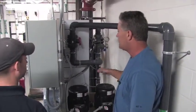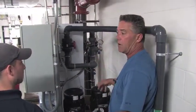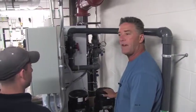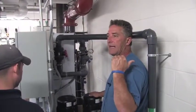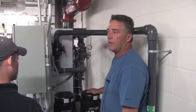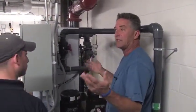So this is pretty much all the system's going to do — just recirculate. Something fails on it, something breaks, just turn it off. There's no filter at any time? That's correct — we just have city water filled into that tank, that was clean to begin with, so there's no need to filter. All we're doing is maintaining one ppm of chlorine. It's just like a swimming pool, just to keep it clean and nothing grows in it.